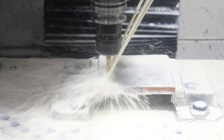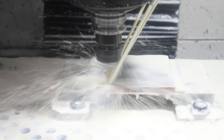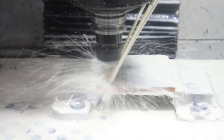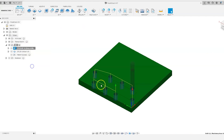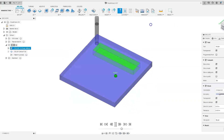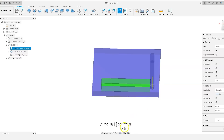The next piece of material I picked out was a block of D2. I then proceeded to run two different tests side-by-side: a pre-drilled test and a non-pre-drilled test to see what kind of differences there were. Even though our D2 tool steel is in annealed state it still measures out to be around 35 Rockwell hardness, compared to 4140 which I measured out to be around 20. It's a tough, strong material and I wanted to use standard tooling just to see what kind of results you would get.